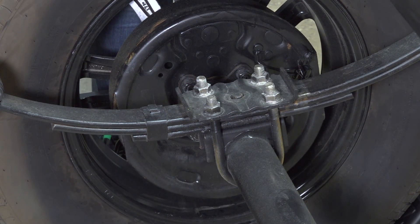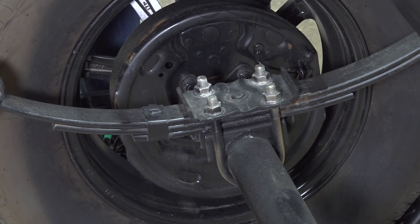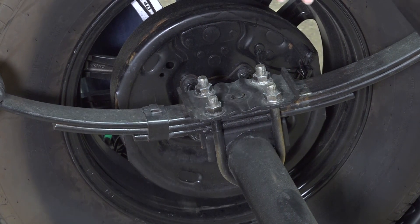Also, if you have hydraulic brakes, your inlet port should be facing the rear end of your camper, and that's to help prevent road debris from getting into that port.